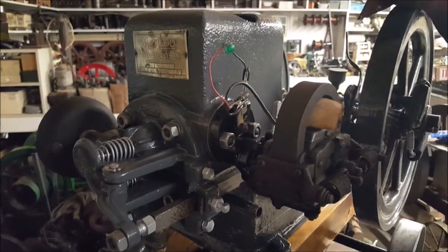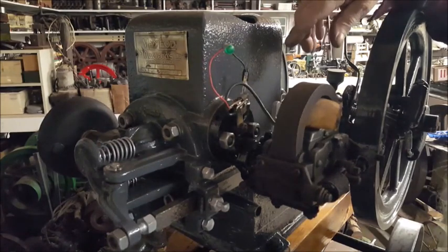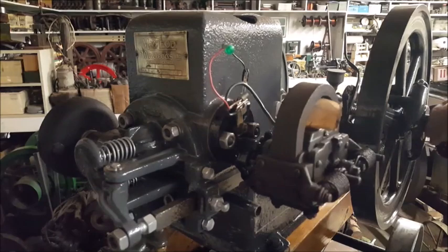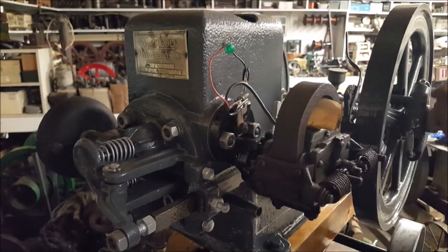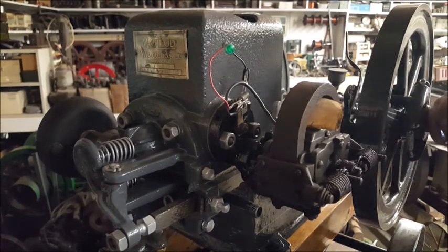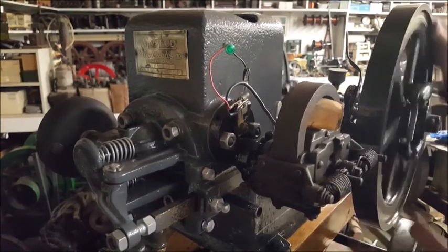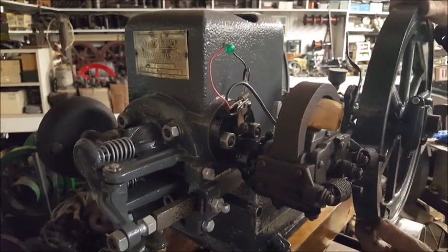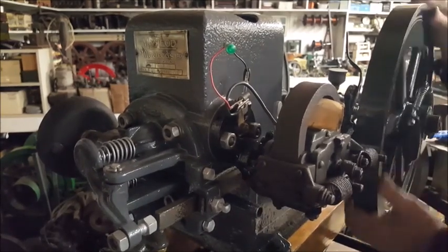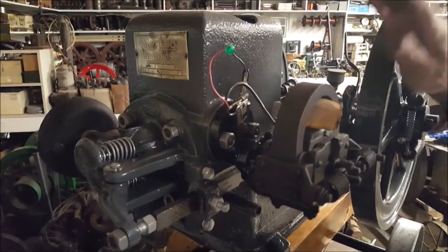If there would have been some fuel in that cylinder and the compression is correct, we'd have a running engine. It fired right at top dead center, which I actually prefer a little bit. It seems like the engines run a little bit softer — but be cautious not to time it too late or your engine would run warm. Let's spark it again. Now it has suction — hear it? That's how to use a timing light on a low-tension ignition system.